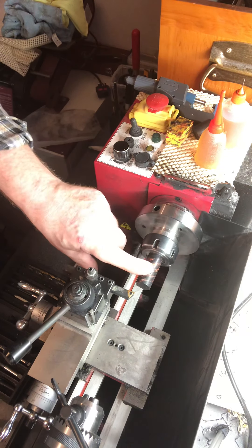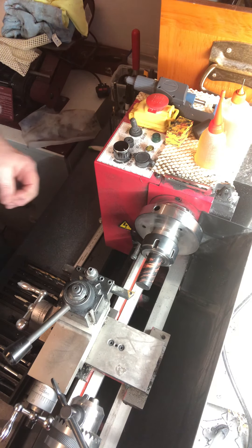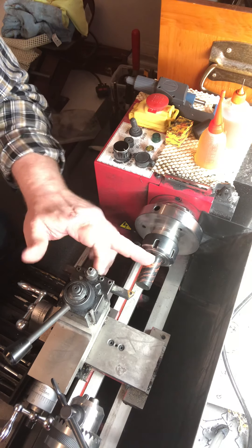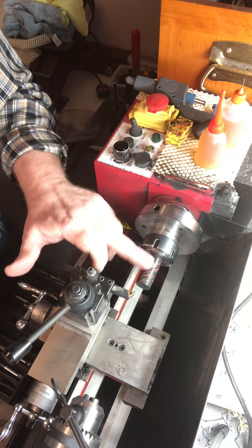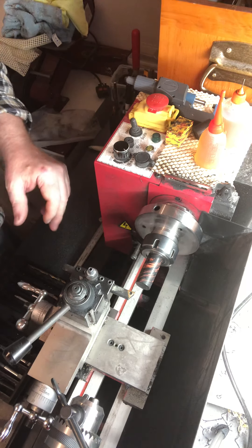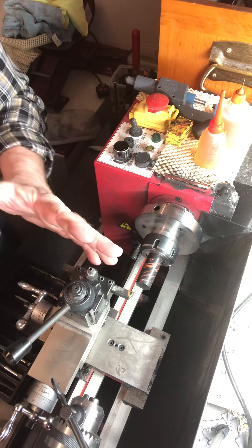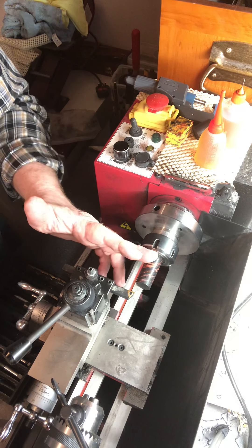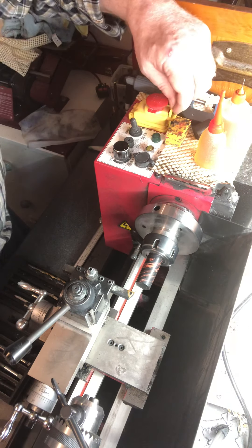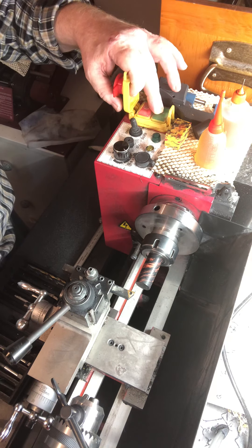I've loaded a piece of ebonite — red streak ebonite with black — into the collet chuck. Looks quite nice. I'll go through number one: form the tenon for the M10 thread. Secondly, I'll turn the ebonite down to 13mm, which is the right diameter to suit the M14 cap you'll see later on. Then finally I'll turn it round and form all the inside drilling and tapping. It's important to do it in that order so the piece doesn't snap when you're machining it. Do all your outside turning, then do your drilling and tapping.